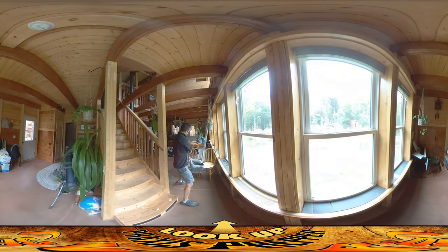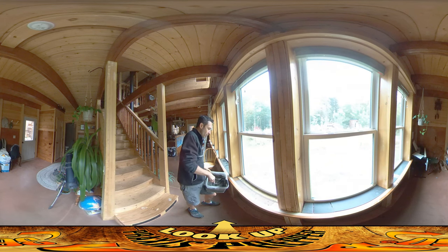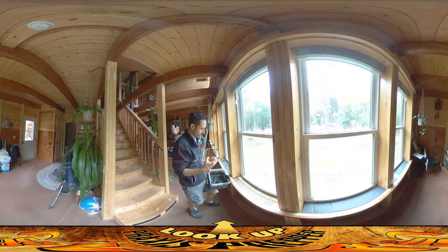These are the tiles that I have cut. I had them outside and I sprayed them off with the hose to get the dust off and also to pre-wet them. When you are attaching concrete to rock, you want to pre-wet the rock so that it isn't sucking any moisture out of the concrete, and also it gives the concrete a really nice bond to the rock.